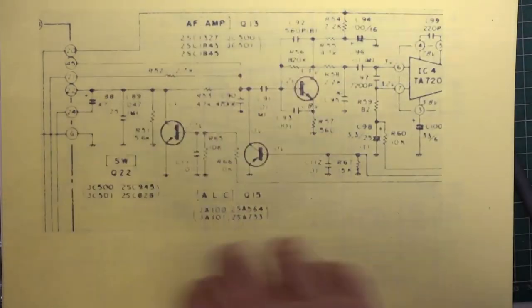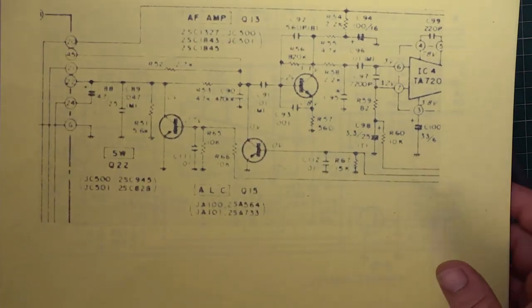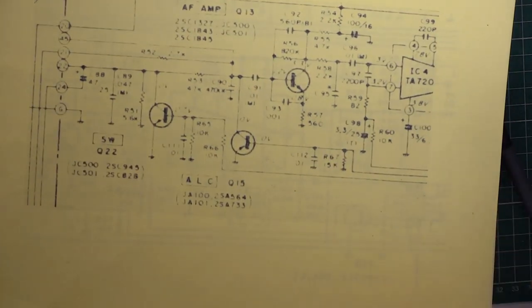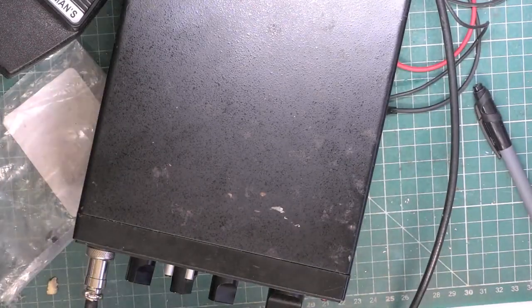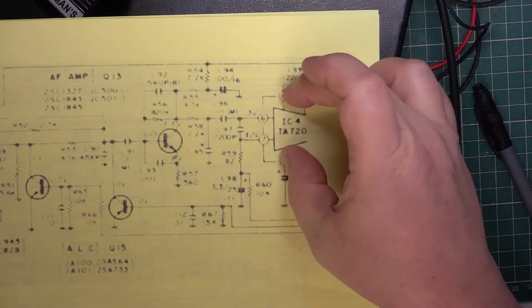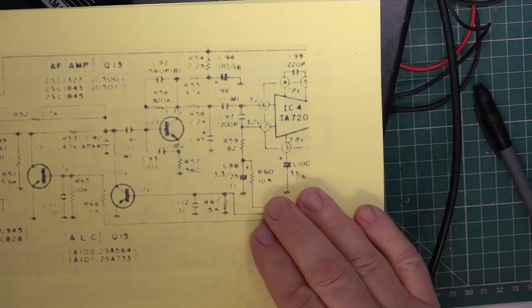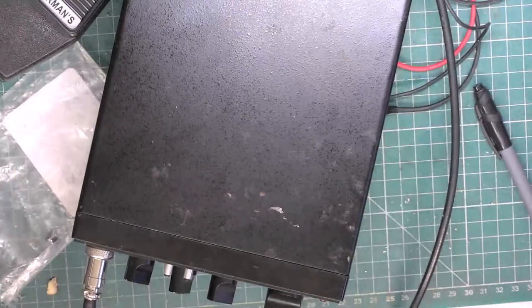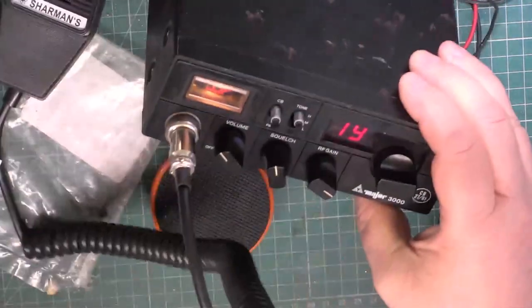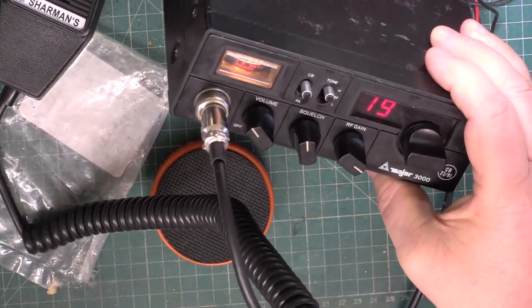We changed the capacitors around. But why is that blown up? Has somebody put volts up it, trying to put some dodgy power mic on? I don't know. Or have the capacitors killed it? So we have the preamp section of that audio IC dead, 2 capacitors needing changing, and that transistor. So quite some extensive fault finding, and I hope you enjoyed it. The on-the-air test is going to be up very shortly because it's already been done. Thanks for watching.